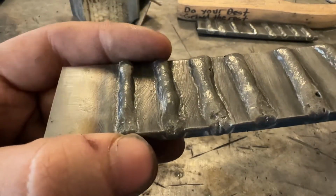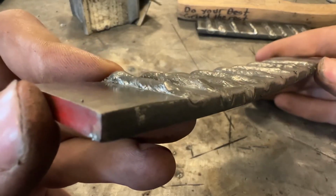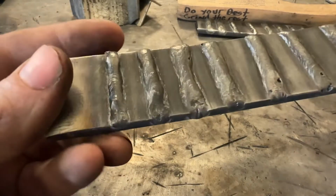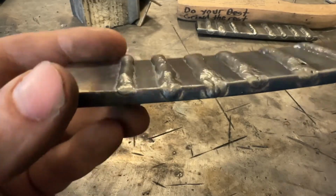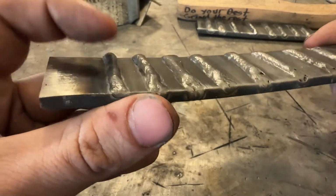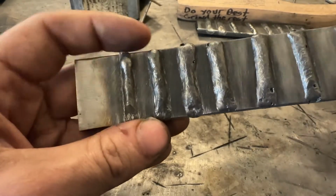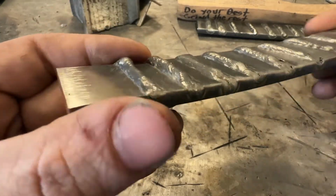All right, what do you see on this weld number 2? And what do you think you need to do to fix it if you feel that it needs fixing? Based on what I see, it looks more roped up than this. So again, our heat to metal ratio is far off. The solution to fixing this should be increasing voltage significantly.